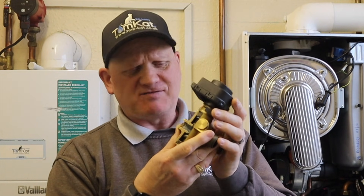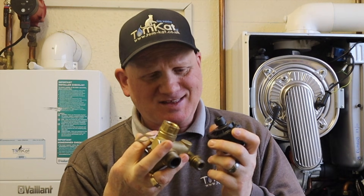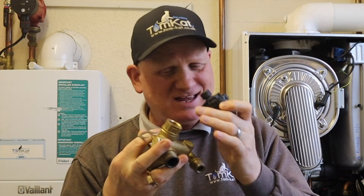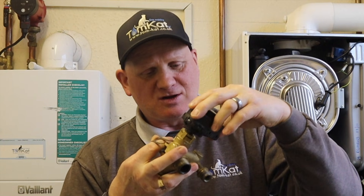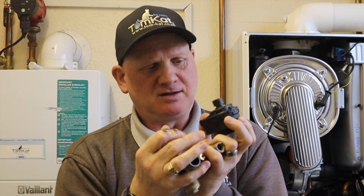How do we remove this motor from the main diverter valve? It's dead easy — all you have to do is pull this pin out and it comes out. This is a dry pocket, so you don't need to drain any central heating water down because it will just pop out once you remove the clip.